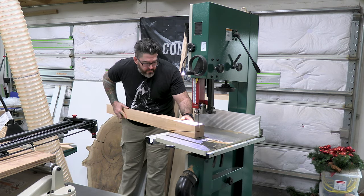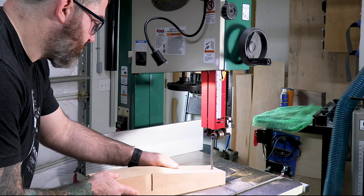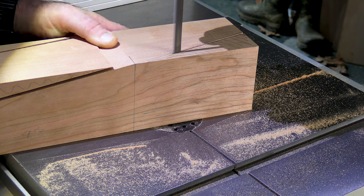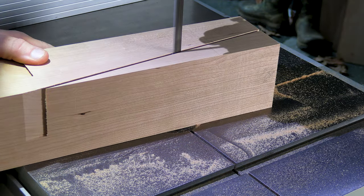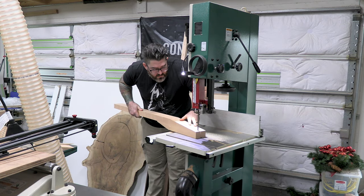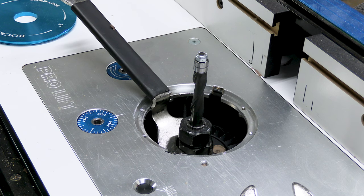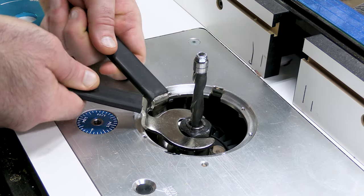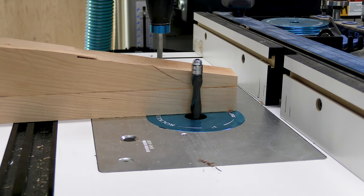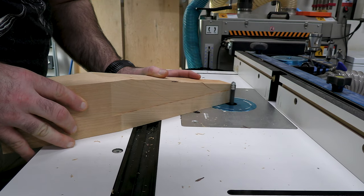After recovering from losing John the tapering jig, it was time to finish off these tapers. I started the cut at the table saw, then used the table saw cut line as a guide for the bandsaw cuts. I had one taper on each leg I couldn't cut at the table saw, so those were done freehand. Then I took everything over to the router table and used a flush trim bit against the smooth table saw face to get a nice clean result without needing additional smoothing.